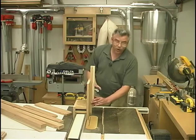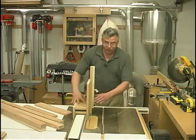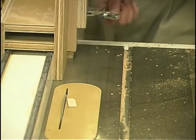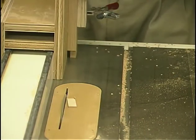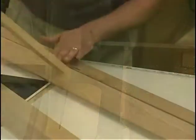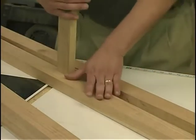We're going to load the work piece in on edge. The jig rides on the fence and we've set the saw blade so that I'm taking away a quarter inch of material on the outside edge of that cheek. Just pass it over, loosen it up, turn the part around, pass it over a second time, and check it for fit. And I'd say that fits up real good — just a few more to go and then we can move on to the next step.